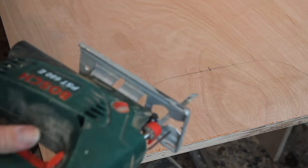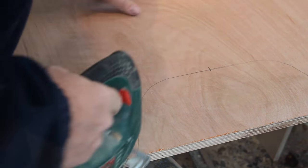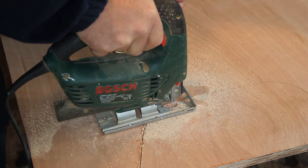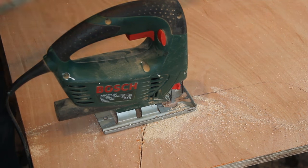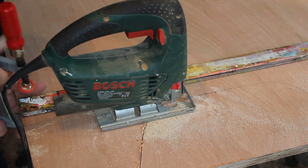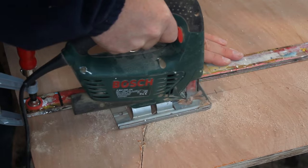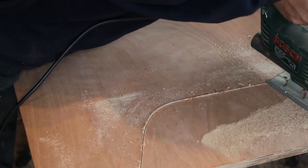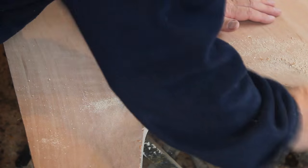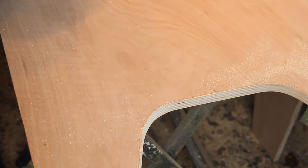Got a new blade in and glasses on. I like to follow this little marker here at the front — you get a nicer curve to it. Having got through to the straight line, it might be good to put a square on there, clamp it down and follow that to get a really nice line. Now, set these edges off here, and don't forget that'll be the back because the cut has left the other side nice and smooth.